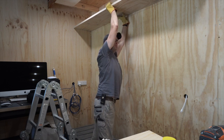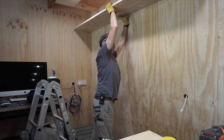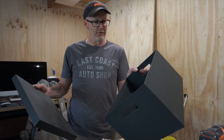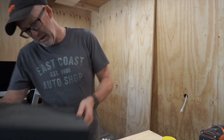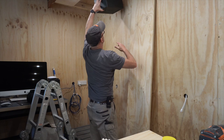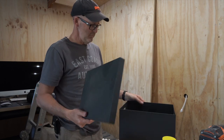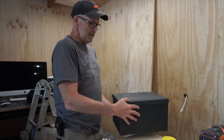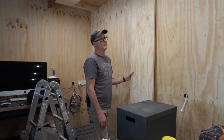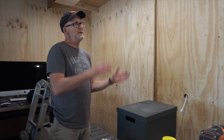I'm starting to wonder if the shelf isn't too deep, because it's pretty heavy — as much as those brackets are very heavy duty, it's still a lot of weight sitting out front. I've got these heavy duty cardboard IKEA boxes which I used under the bench at the old place, and I thought I'd run them along the top shelf to store bits and pieces — cables and odds and ends — because it looks neat and tidy and I can put a label on the front. The boxes are 350mm and the shelf is 400mm, so I'm going to cut it down to 350mm. That'll take a bit of weight out, bring it a bit closer to the wall, and the center of gravity won't be too far out.